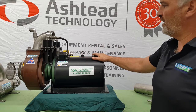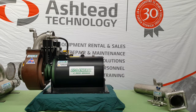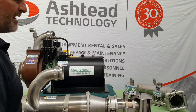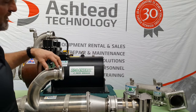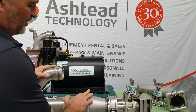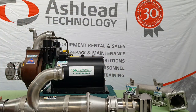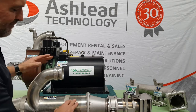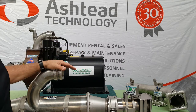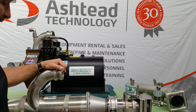So that's the overview on the water pump side of the electric motor. Moving to the Venturi side now — it's the same Venturi system as we use throughout our fleet. When this is in the frame, there's a U-Bend that joins the Venturi to the water pump. In the modular application, you bolt this anywhere you like on the ROV and the supplied hose allows you to remote mount it to the water pump. This is the inlet and that is the exhaust. This is the same patented Venturi throughout our fleet — we're making 64 kPa of vacuum on this particular setup. On the Tornado 4-inch setup, we're making 97 kPa, which is quite simply the highest vacuum of anything on the market. We know that because we've tested other designs.